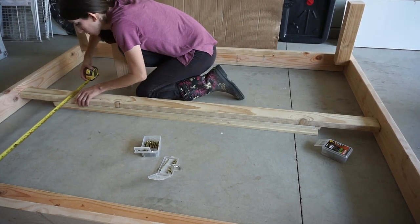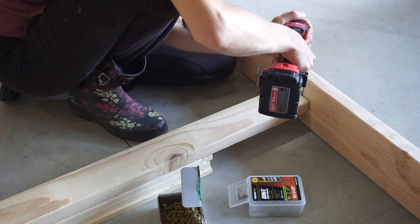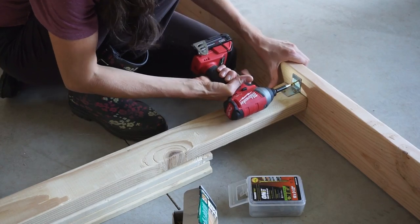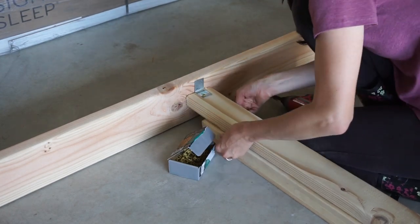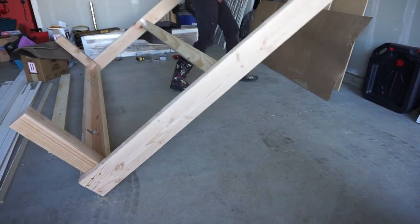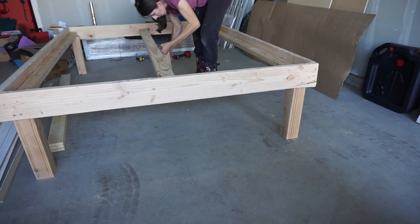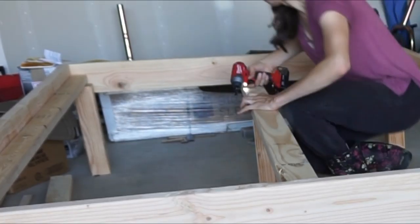For the middle bed support, I'm layering these backwards — the one-by-fours on the bottom and the two-by-four on top — because I'll be attaching L-brackets to the rail. I'll take the other four and put two on each side of the 80-inch side rails to support that two-by-four on the ends. They sell these L-brackets in different thicknesses and sizes, so choose accordingly. I like the thicker ones since they'll be supporting you as you sleep. This is how I've made our king size bed and it's worked wonderfully for seven years.